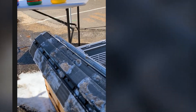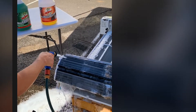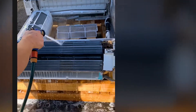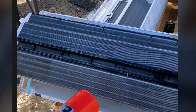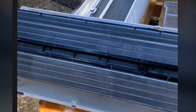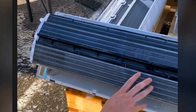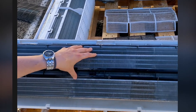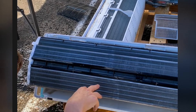Now this is ready to rinse. Start from the bottom — it doesn't really matter once you're rinsing. You can see Viper Aerosol at a 5:1 was very effective. You saw before rinsing that Viper Bright brought a lot of stuff out of the coil. That doesn't mean Viper Aerosol or Viper Heavy Duty didn't also lift the contaminant — it's just that Viper Bright's high foaming content grabs and pulls it up out of the coil, whereas Heavy Duty or Viper Aerosol push it down the coil during the rinse.